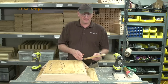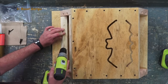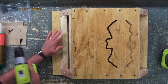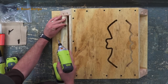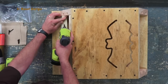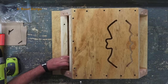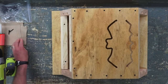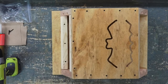Now we'll attach the back roof strip. To keep our screws from poking out the back we'll need to angle them. To keep our roof strip from splitting, we suggest pre-drilling the holes. Use a 1/8-inch bit at about a 45-degree angle to drill three holes. Then finish off with three screws, taking care not to over-tighten them and split the strip. Don't worry if they split — roof strips don't really hold weight, but they help make a better seal.